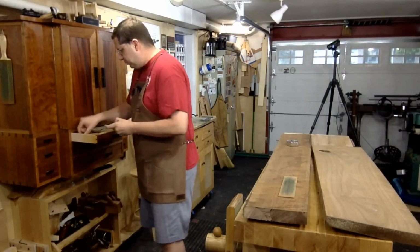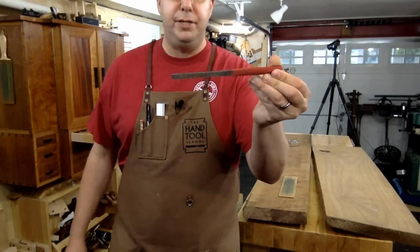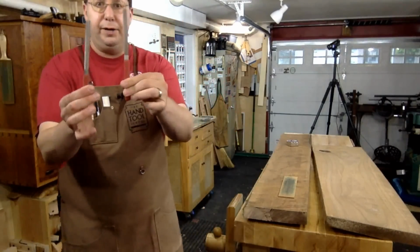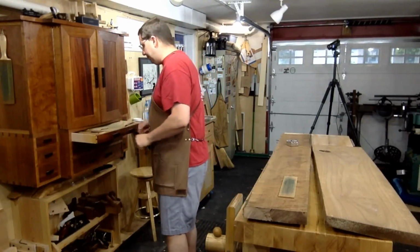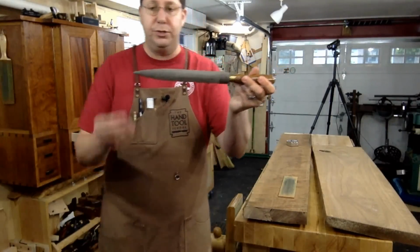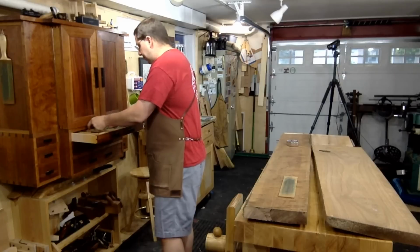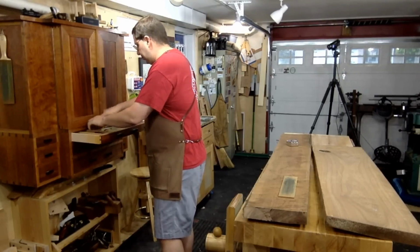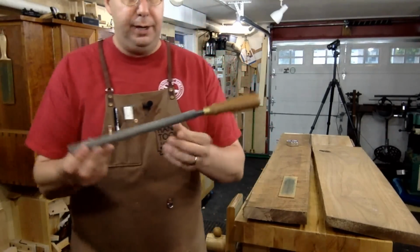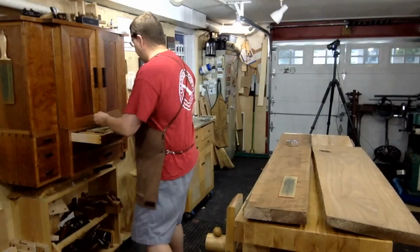And one that I've been using for probably 6 or 7 years now are these fine Iwasaki impulse hardened Japanese files. These actually create more shavings than dust. They're pretty sweet. I've got one in a round and one in flat. But for the most part, if you're just getting started, a good cabinet maker's rasp, 9 grain, this is an RU. This could do like 90% of the work that you need. And then get yourself a file. The file that I use the most is this Nicholson cabinet maker's file. This is a smooth cut file. I had to make my own handle for it, no big deal. And this one follows up the work from the RU rasp and pretty much smooths anything out.